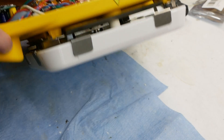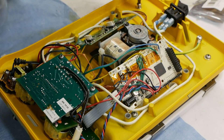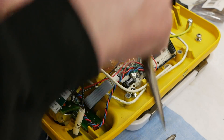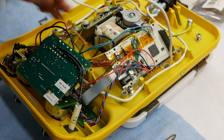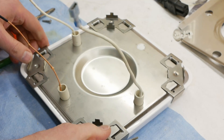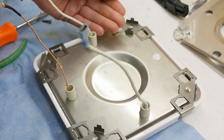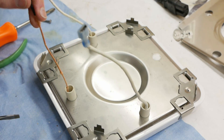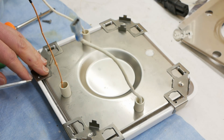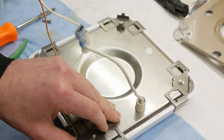Let's keep taking it apart so you can see what's going on. Here you can see the heating elements are these two, and then the coil that I added is these really fine magnet wires here. This is a thermocouple so that the machine knows not to overheat the element. The idea is that if you want to heat your beaker of water up to 100°C, it just slams the heater on full, and eventually you don't want to overheat the elements, so it needs to know the temperature of the elements to avoid that.